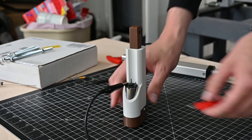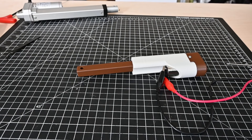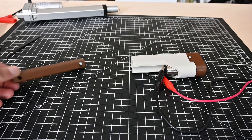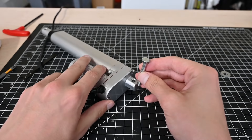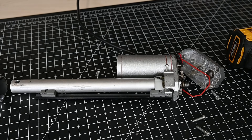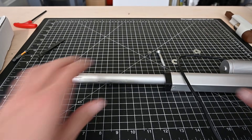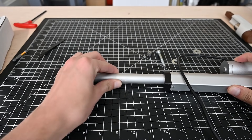There are a couple of issues with this design, though. There is nowhere to attach the bottom of the actuator, and there are no limit switches to detect when the actuator has reached the end of its stroke. On off-the-shelf actuators, you can see there is a little nub with a hole for a pivot. It also has a configuration of diodes and limit switches to allow it to stop before the arm detaches or bottoms out. So let's make a second version of this actuator with these changes made.